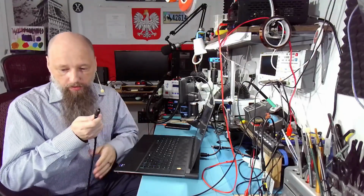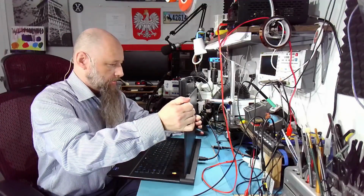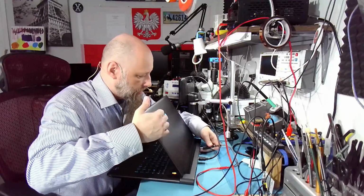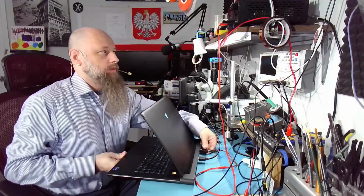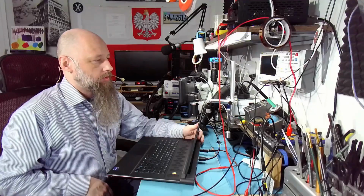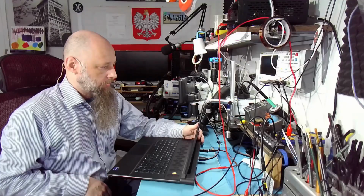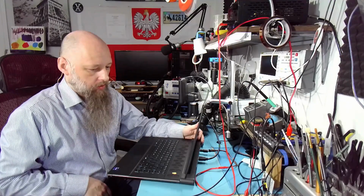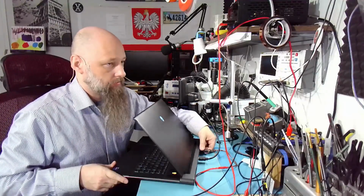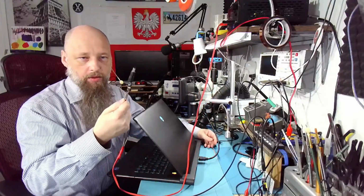So issue number one, let me actually show you that. I should be able to show you. Estimated time remaining 2.5 hours. That sounds okay. Let's give it 19.5 volts. Okay. Now it's not saying that it's charging, right? It is pulling 38 watts, roughly 40 watts, but it is not charging, right? That is because we're using just power, no ID pin.